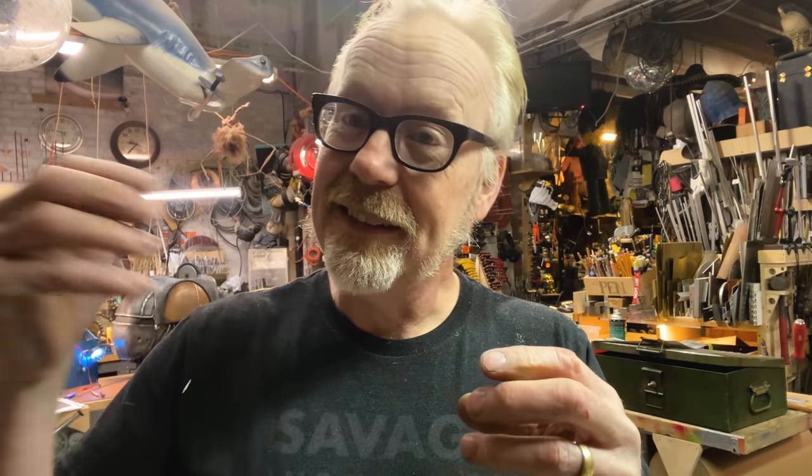Instacast is a type of one-to-one urethane two-part casting material that makes a plastic, what everything in the movie industry is cast out of. And it is hygroscopic. It wants to absorb water. When it is old, it absorbs water every time you open it. You crack open Instacast and it wants to draw moisture out of the atmosphere. So you want to crack it, pour it, mix it, and reseal it.